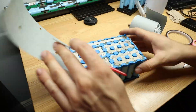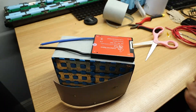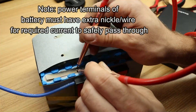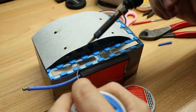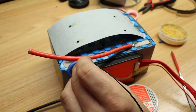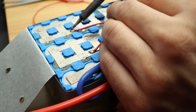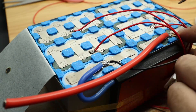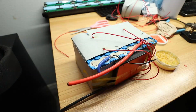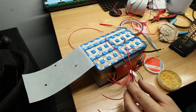The paper I'm using here, that you see a lot of people using in their e-bike batteries, is called fish paper. It's like twice as thick as cardstock and it's made to keep the battery leads and balance wires from getting in contact with anything on the battery itself, which causes short circuit. You definitely want to make sure you're using this as a safety precaution. Kapton tape is also really useful to keep those wires tidy. I'm also putting a little drop of solder onto the parallel connections so that our BMS system can track the voltages of each bank of cells and balance out the cells while charging — that's vital to ensuring the longevity of this battery.